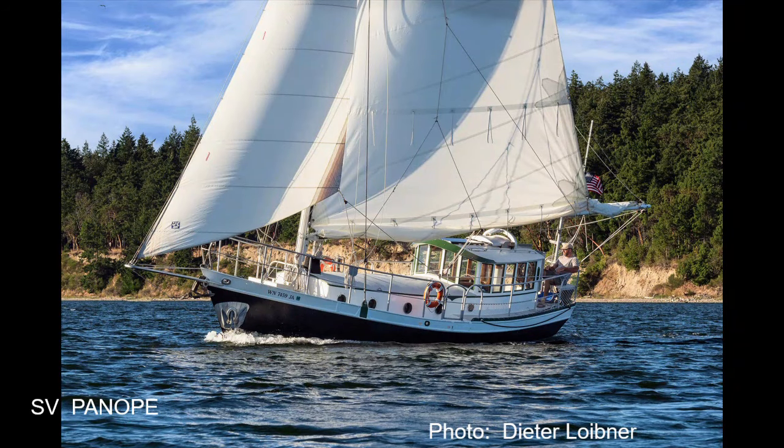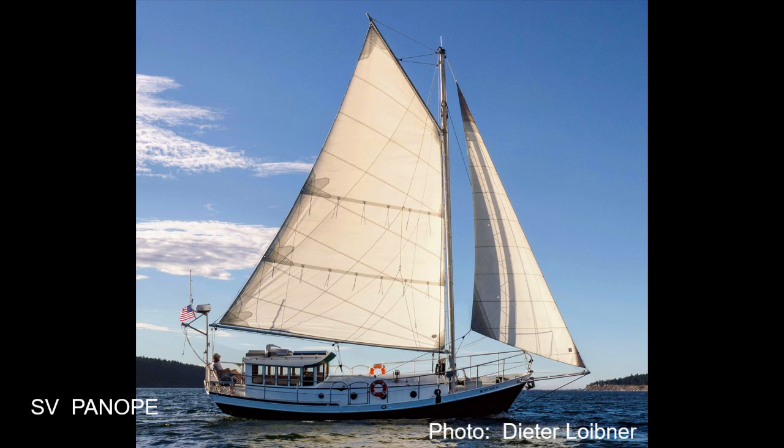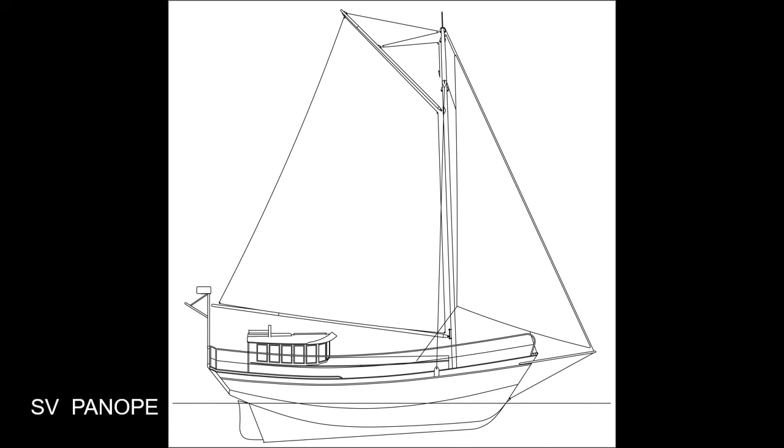The working jib that I've been using with the new bowsprit does not have ideal dimensions. It's a second-hand unit, and as you can see, it's a bit short on luff, maybe about 2 feet short, and perhaps a bit more foot could be used as well. But in spite of that, it works really well. Not sure the boat is any faster, but it does point a few degrees higher, and of course the balance is fantastic with that center of effort being just a bit farther forward.